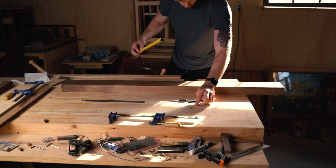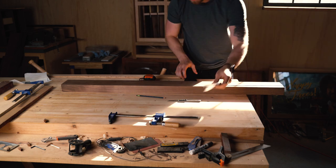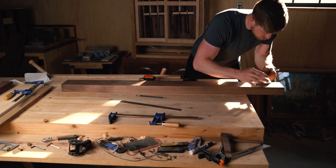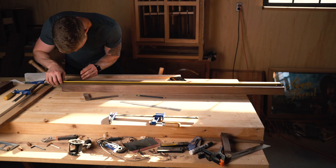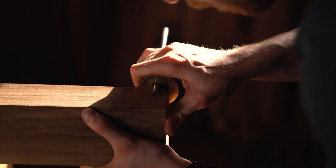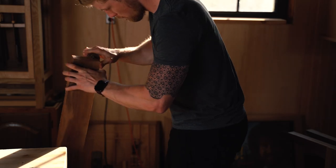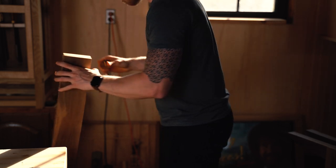Here I'm actually doing the shoulder-to-shoulder dimension, and just like all the other episodes, the link to the SketchUp file is going to be in the description. If you're curious about the shoulder-to-shoulder dimension you can just base what I'm doing off the dimensions from the SketchUp file. The importance of the shoulder-to-shoulder dimension is it gets everything exactly to size even if there's a little discrepancy in the size of the tenons. I'm just laying out for the double tenons, following the SketchUp file — nothing crazy going on.